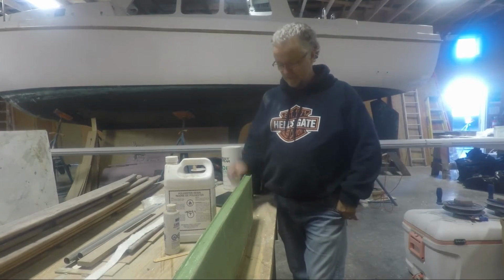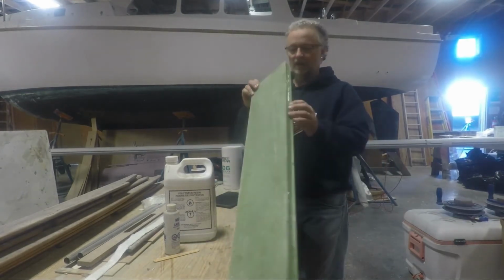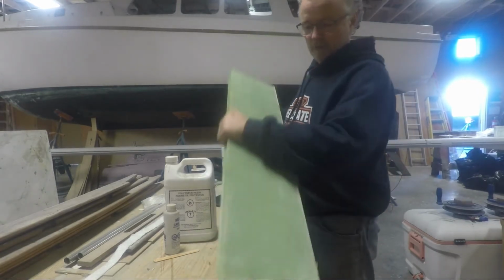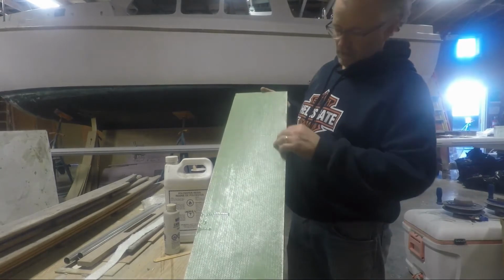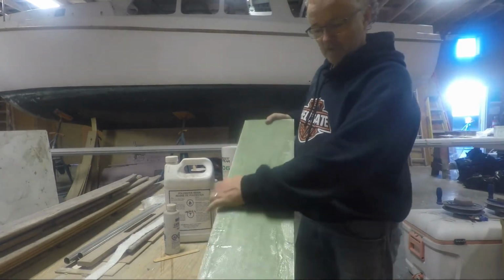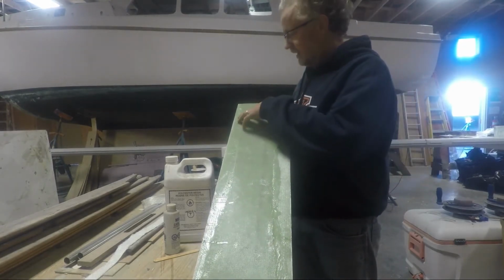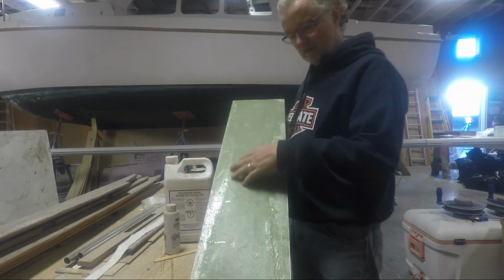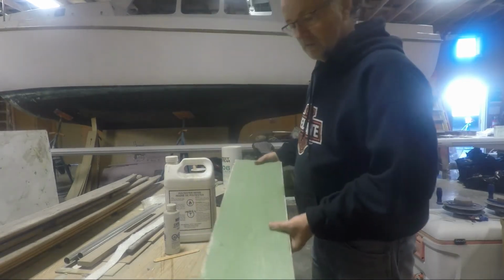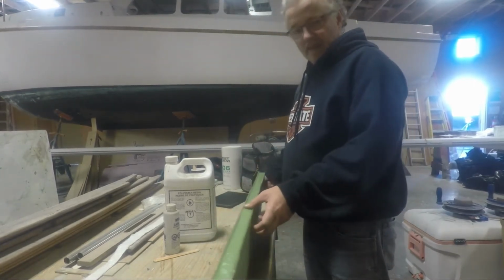Here we are back at the shop. This is my new dinghy seat, and the process that I have used for it is to take some foam. I put two layers of biaxial fiberglass on this side, and I put two layers of biax on this side with an additional layer of heavier biax underneath to give it some strength. So when it gets set on, it's going to be nice and strong. Then I ran